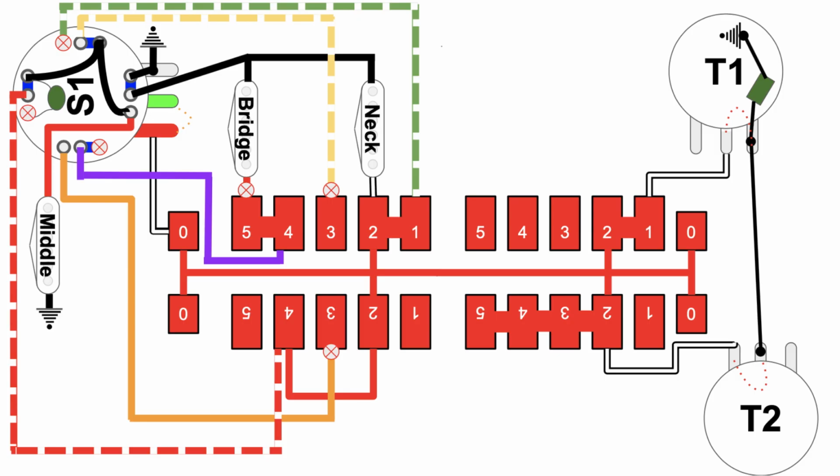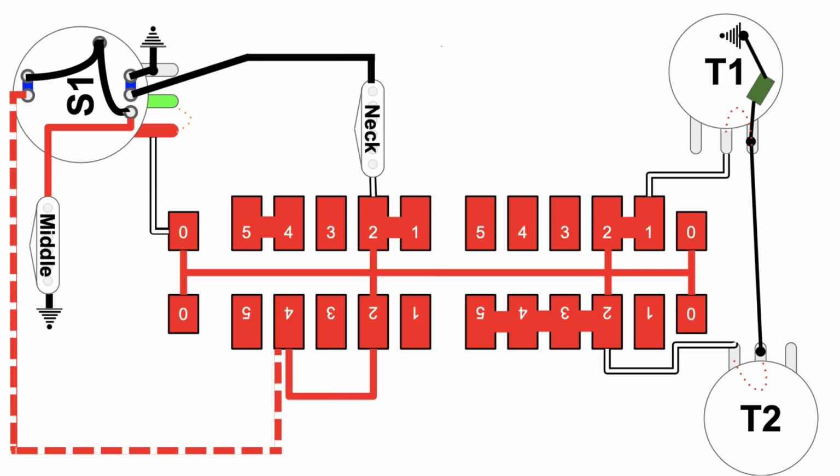So if you want to check it out, figure out where to be testing for continuity, that there shouldn't be any. For example, you could test from node 3 to this middle node over here. There should be no continuity. There should be no audio on that circuit. Actually, you wouldn't test from there. You would test from the backbone to this location to prove that 3 is not making a connection to the backbone. All right. Now that we have these red X's up, let's go ahead and knock those connections out.